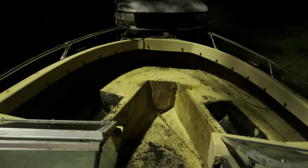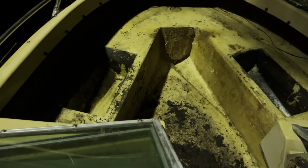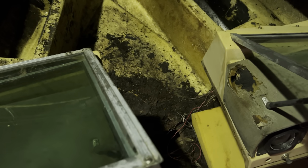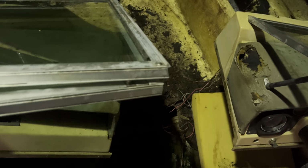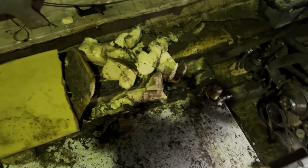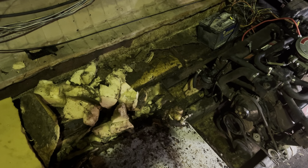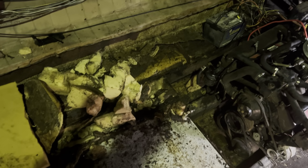All right, so 9:30 p.m. update. The whole front of the boat's gutted. We got good flooring up till about 6 inches from that hole there, and then it gets soft, so we're gonna cut that out, replace it. We started ripping the foam out of it. It's a lot harder than we thought, so we're gonna change our attack tomorrow. Coby's gonna work on it while I'm at work because he's off.